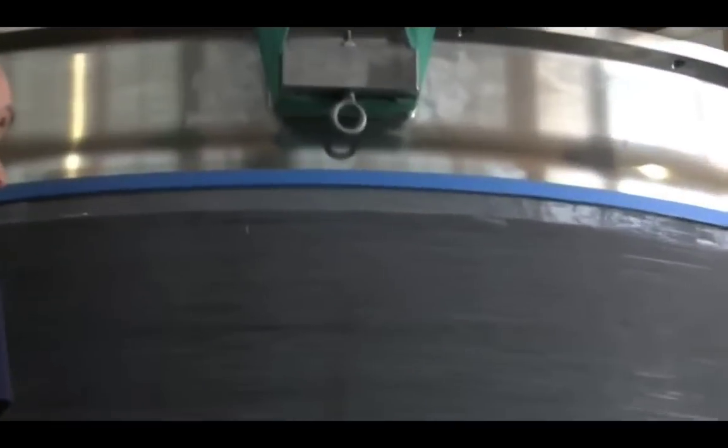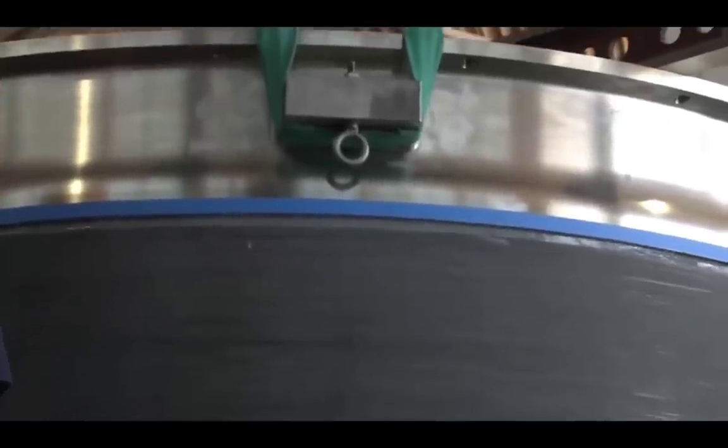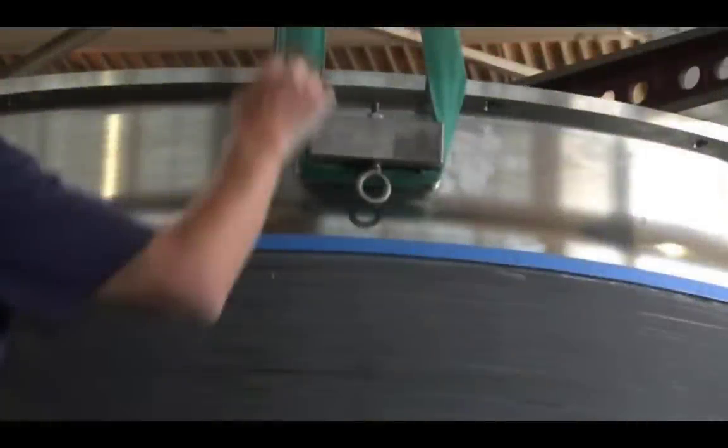This will be the pressure vessel for Cyclops 2, going to 4,000 meters — the deepest dive. The measurements look like they nailed it. As far as the glue bond from top to bottom, when they level off the top they use indicators and assume a 100% bond. With that said, they could lift it back up and check coverage — or if it's not critical, let it ride.